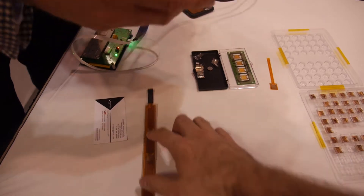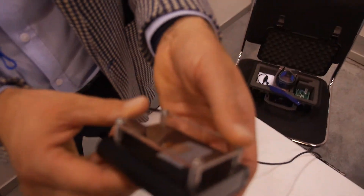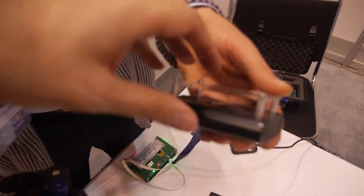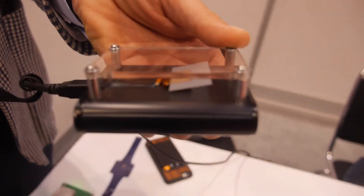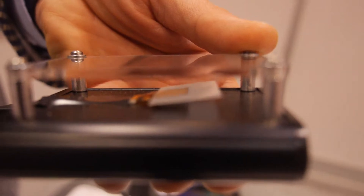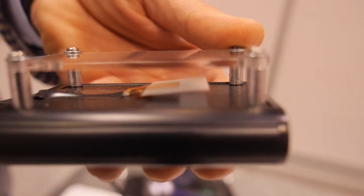When you apply an electrical field, you can have a bunch of these on a strap. You have four there? So what's happening is that when you apply different electrical voltage, the actuator can vibrate the surface of the product that it's attached to. So you can see here we can vibrate very slowly, a few hertz, and we can vibrate at a very high frequency as well.